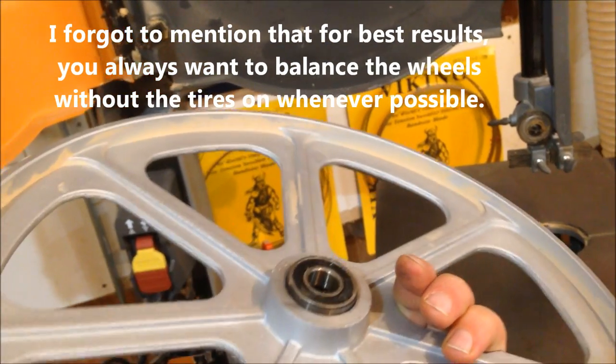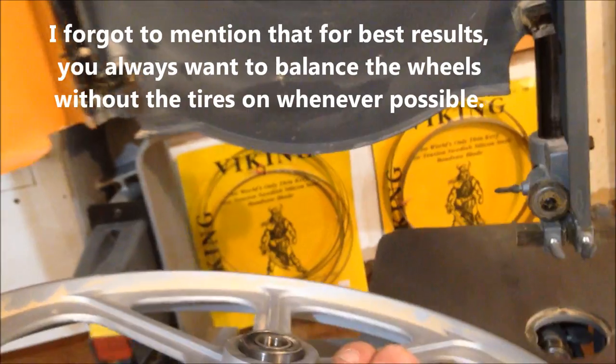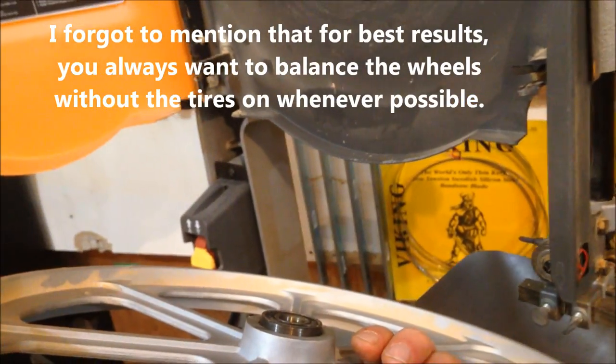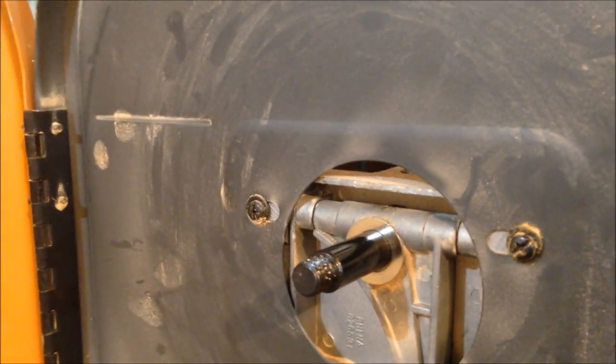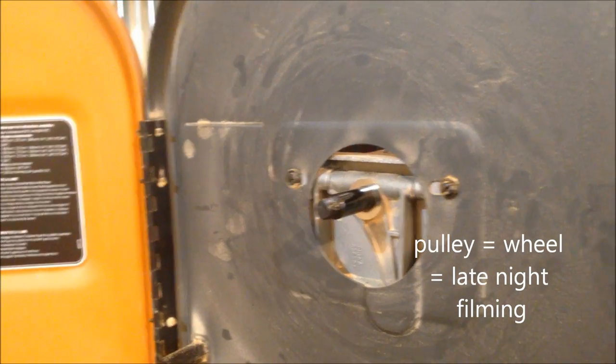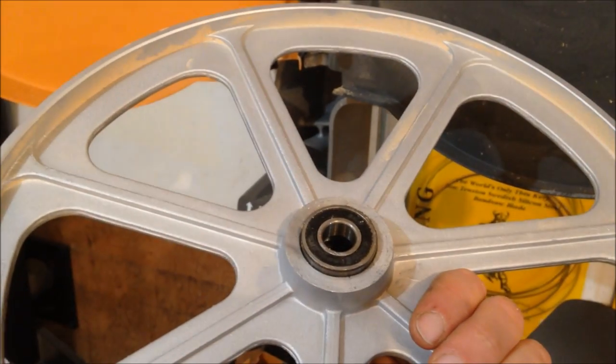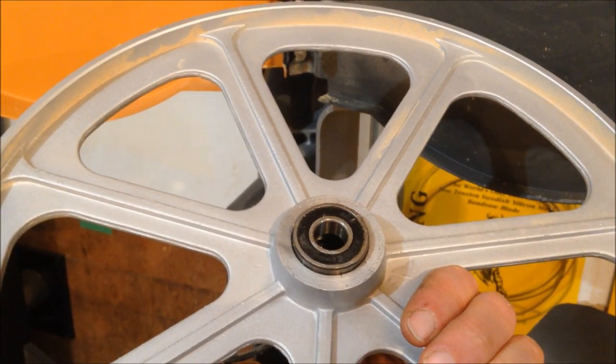Generally speaking, this bearing is not sitting flush — it actually presses in more. There will be some sort of flange, a rub collar, or a washer. In this case, a ten-cent washer. That's going to give the clearance the pulley needs away from the casting, so that the bearing and pulley operate without the flange of this pulley dragging on the post of the saw.